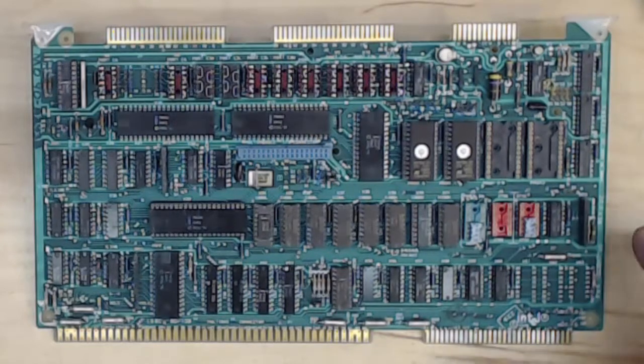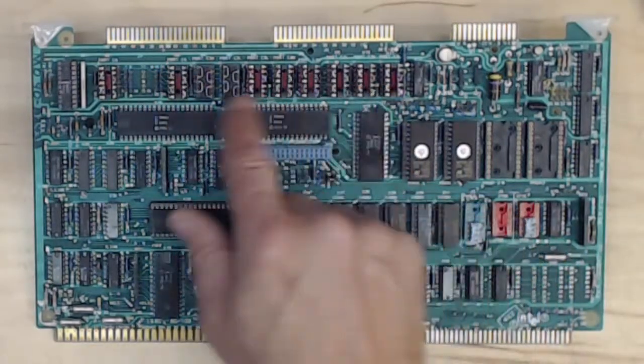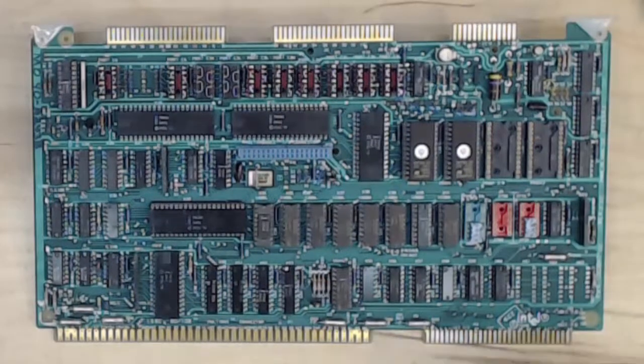In a later video, I'll start talking about some of these boards in detail. If you go out and find a board, you'll see that a lot of them have empty sockets. Some empty sockets are not critical at all — a lot of boards have no ROM at all. Some sockets are just for jumpers or drivers and are often completely vacant. The memory will often be gone, but there are some key chips that the board simply won't function without, and they're very hard to come by. I'll talk about my favorites so you know what to look for when hunting one down.